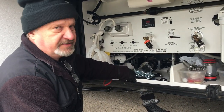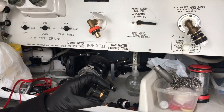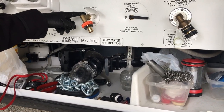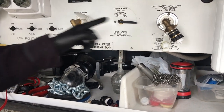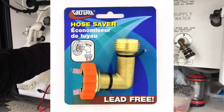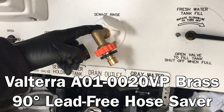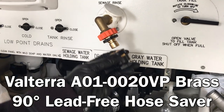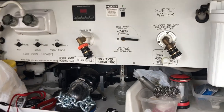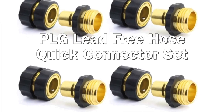The last tip I want to talk about — and it seems silly — is these quick disconnects. I can't tell you how much trouble these have saved me by not having to disconnect this connection all the time and have it eventually leak and wear out. And likewise, the 90-degree elbows I put on took the strain off the hoses. It makes it so this joint is not one that's going to wear out just from the frequency you're using it.